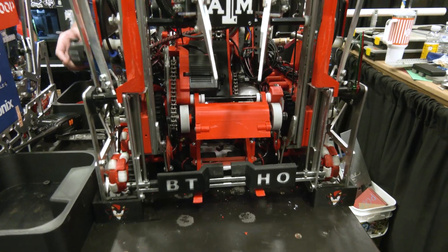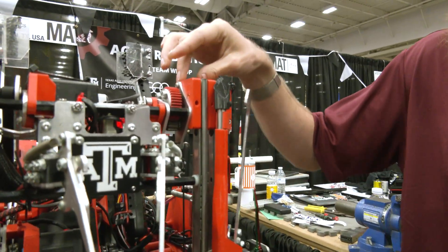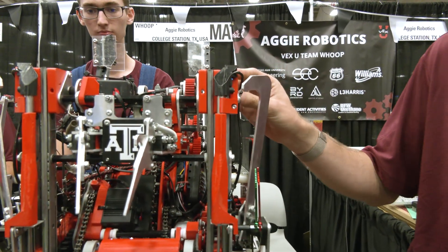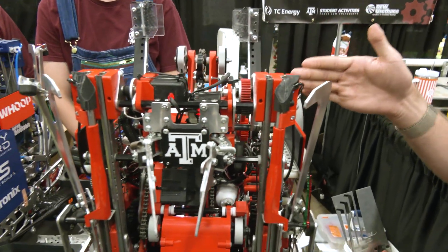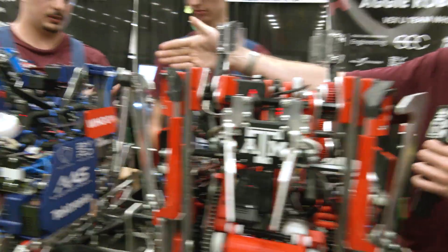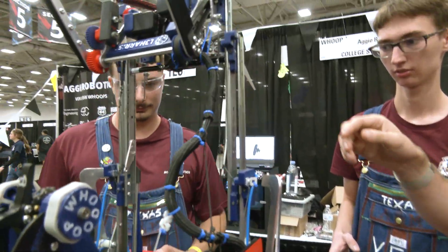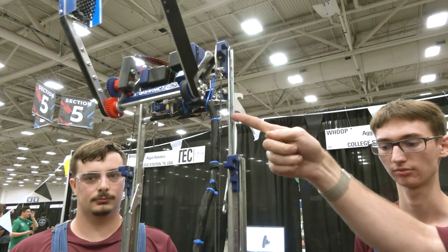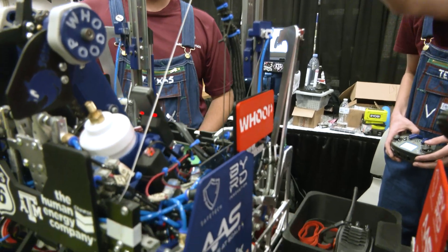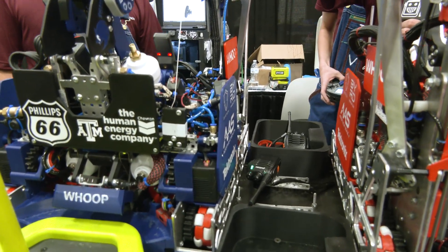The next most important thing is our hard stop. We move our intake out of the way and it goes all the way down to the bottom, which gives us the best cantilever by increasing the distance of the pivot point. Next, we take a look at our slides — we have a fully custom slide stack. We 3D printed these slide spacers; they even have inserted standoffs to add strength. The most important thing about this is tensioning — it's always the hardest thing with slides. With Sonic, we have a fully custom tensioning system using surgical tubing and a spring on the bottom, so we tension both our extension and retraction. The best part is they bottom out, which means it's literally impossible to break our tensioning or stretch out our springs.